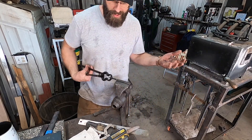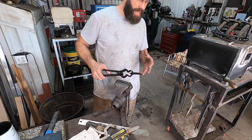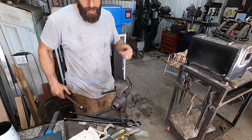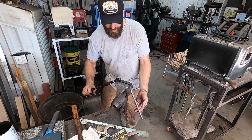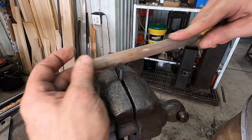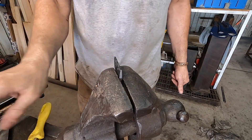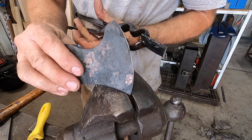That quenching temperature was probably closer to 1600 degrees, but the temperature doesn't matter much here – we're just doing a quick simple test. If it's mild steel, you can get it to 1800 degrees, quench it, and it's still not going to harden. First I'll stick this in the vise and hit it with a hammer – that's a good sign, it's brittle, which means it's hard. Now the file test: except for a tiny divot, it is not digging in. A huge difference from the bad hatchet steel.